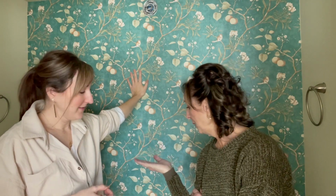And then the other big difference was, as we were cutting all the edges, the paper was tearing very, very easily. And perhaps that is the quality of this paper as opposed to a more expensive paper. I think the biggest thing is, because you're cutting wet paper, it's so important to have a good blade each cut. So every single piece of paper I put up, I used a fresh knife, a fresh blade, so that it keeps it good and sharp. And mine were always just the breakaways, so it made it easy to do. But I think that's the most important thing, cutting wet paper. Sharp knife. I did not have that.